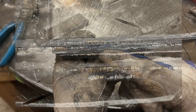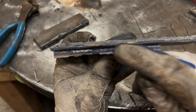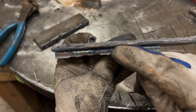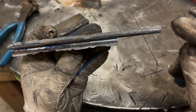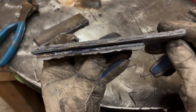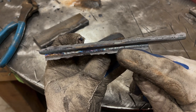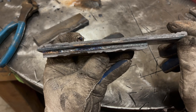And then you look at the overall gray, which is where the weld penetration is, a dull gray, and it barely penetrates at all for most of this. Because you can see the shiny metal, that's base material, that's not weld. Well, when you compare it to this upper one, which is the one we just broke, the weld is about a third of the way through the plate end to end, so significantly further, deeper penetration, way more consistent.